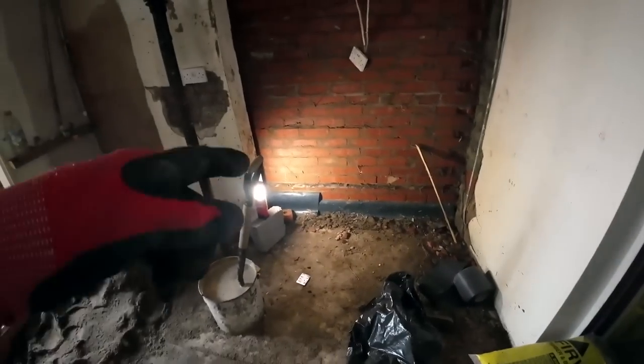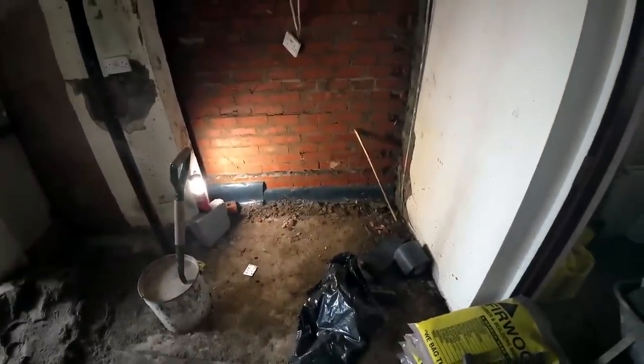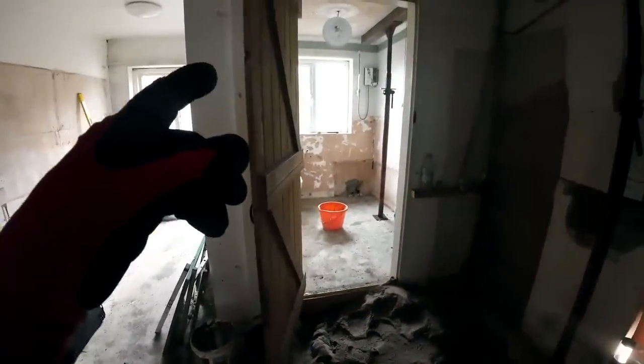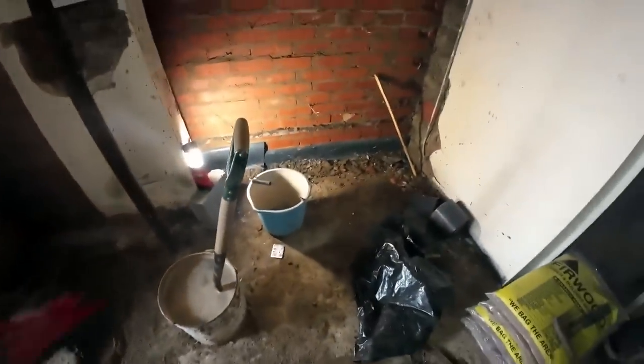Yeah. And outside, you should have put the viscreen little tray in just to give it a bit of protection against the ground. We're going to put sand down, fill the gap up with sand, then top it up with a bit of sand and cement. So that there's 3/4 limestone out there, but instead of using that stuff, we don't want to punch the plastic, so we're going to use the sand. Right, bash it down and point over it.